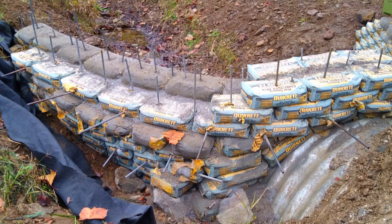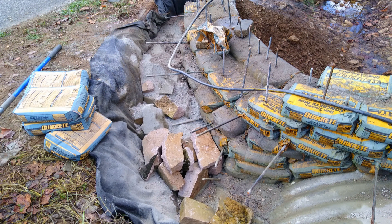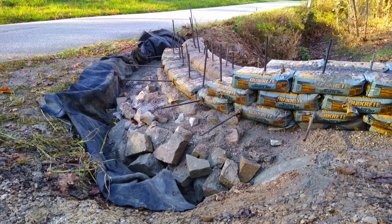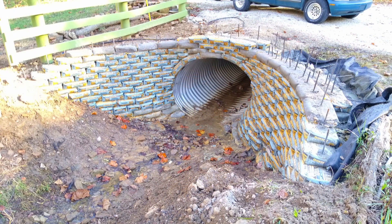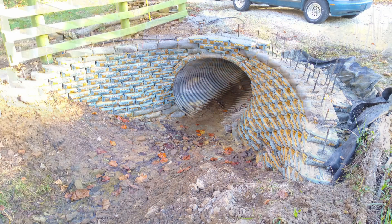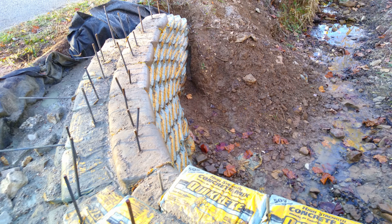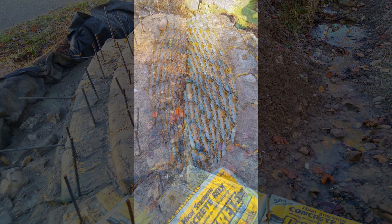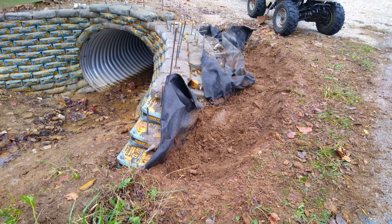Starting to make some real progress here, so I decided to backfill this area with some rock and various items. I broke up some sandstone and there's some limestone in there. You put the concrete right on it dry and then it just adds some water and sets right up. I'm not really mixing concrete in there — I'm just putting it in there and it sets up as solid as could be with all that rip-wrap and rock.